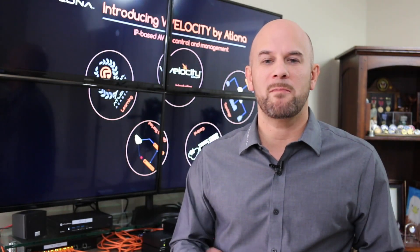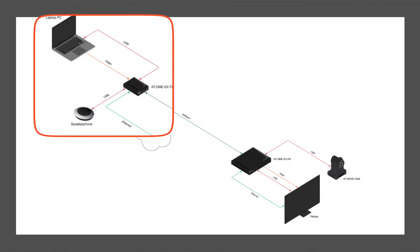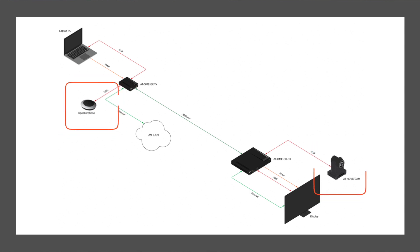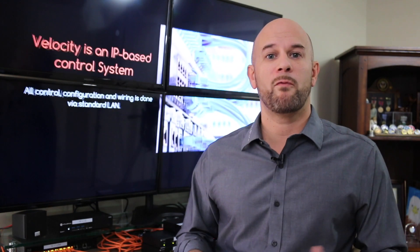Let's talk about the USB features on both the transmitter and receiver of the Omega kit. You have both device and host connections on the Omega Extender Kit. The host connection is for your PC. When you walk into the room to begin your presentation, you'll connect not only the HDMI cable but also the USB cable from your laptop to the host input. You'll also connect peripheral devices in the room — such as a camera, microphone, or speaker — to either the transmitter or the receiver. This allows your laptop to communicate with those peripheral devices over the HDBaseT connection, enabling easy BYOD and conferencing solutions for huddle spaces.